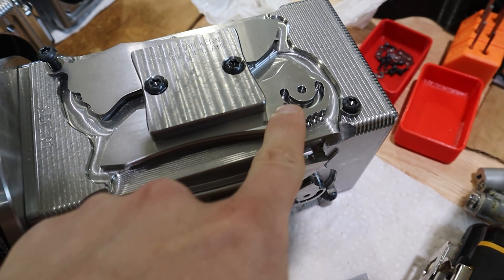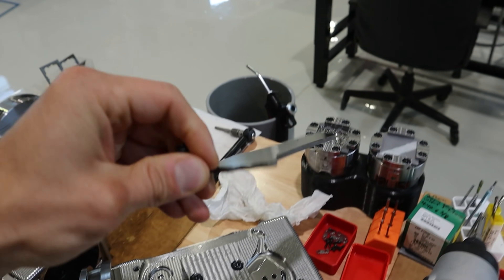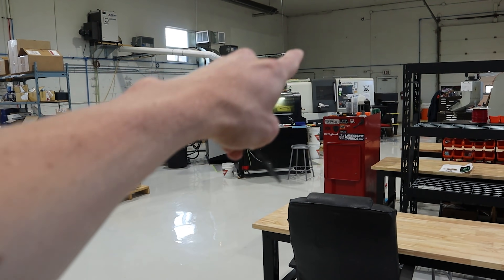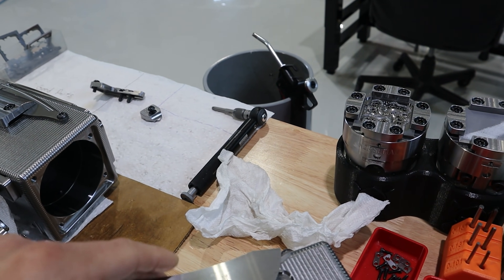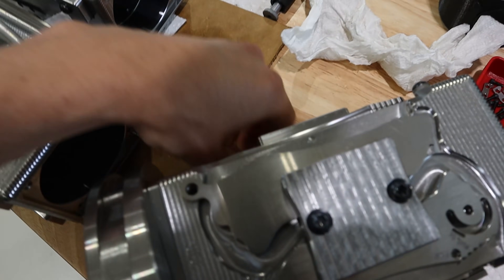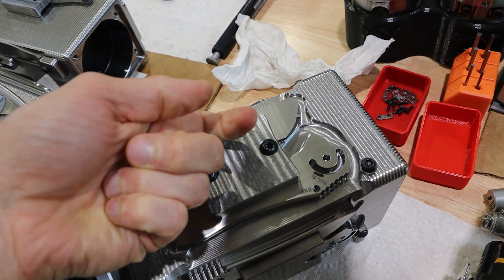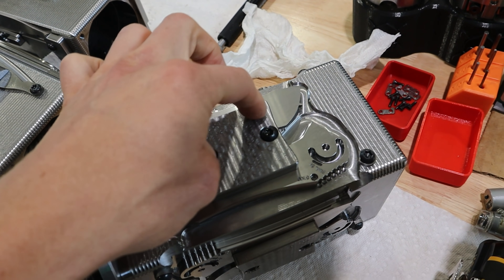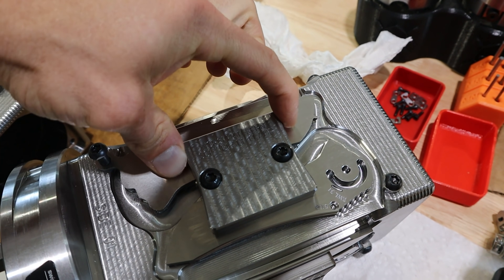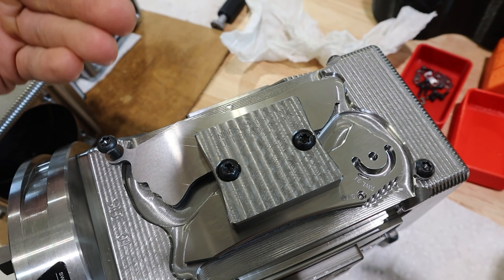Real quick, I'll show you the tombstone that I came up with to make the Norseman blade. Here's one of our waterjet blades — at this stage it's been waterjet cut from a big sheet of stainless steel, then surface ground on our Okamoto surface grinder in the back corner. Then it goes on the fixture one-handed — it is awkward. One screw holds it down on this side and the top clamp holds it down on this side. We dimple the backside of the top clamp so it actually digs into the blade and leaves little dents. But because we only have one pivot point and only a little bit of traction on the bottom of the clamp, theoretically the blade can move depending on friction and tightness.